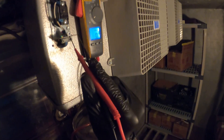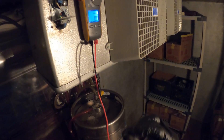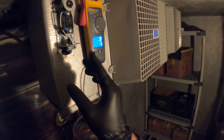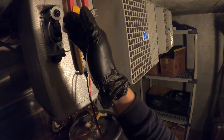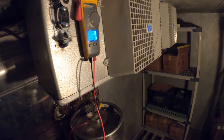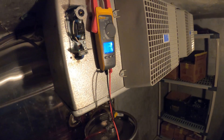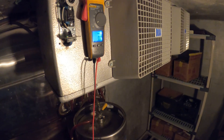The reason that I am changing this thermostat is because it doesn't satisfy at the right temperature. It is getting off — it is five degrees off. So if I set it to 40 degrees to shut off, it's actually getting way colder than that. If it's either too warm or too cold and it's off by a certain amount of degrees, that's when it's time to change it.